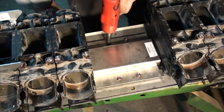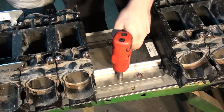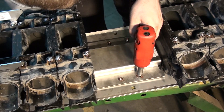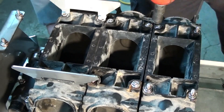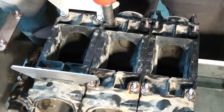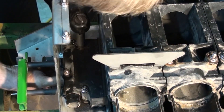Install the center cover plate. This part will be sized according to how many runs your air seeder has. In this case we have 6 runs, but we would select a narrower cover plate if we had 8 runs. Use care not to damage plastic components or overly compress gaskets. In most cases, bolts can just be snugged up, or for some harder to reach areas, just made wrench tight.